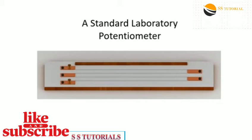And finally, the major difference, though, is not the physical structure, but the underlying principle of working, which we will see in a while. A meter bridge works on the principle of a Wheatstone bridge, whereas a potentiometer works on the principle of potential gradient, or potential drop per unit length of the wire. This we are going to understand more deeply in the next part.